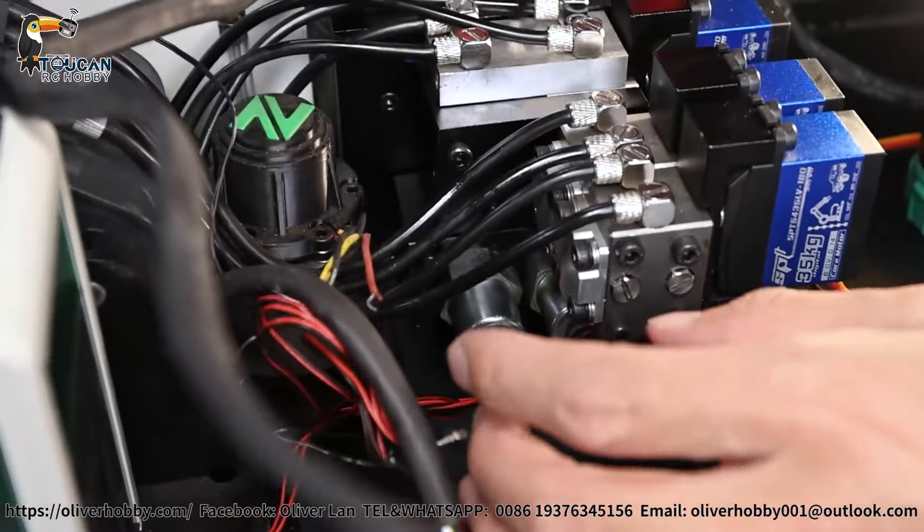Here on the left side, this box is the smoking sound unit. First remove the top two screws, then this cover you can remove. From the bottom there are two more screws securing it to the bottom plate. Loosen those two screws and this unit can be removed. All the plugs you can pull out together with the receiver, or unplug them individually.